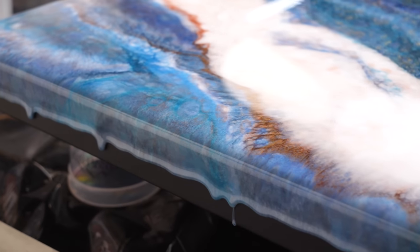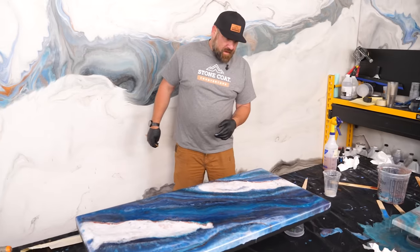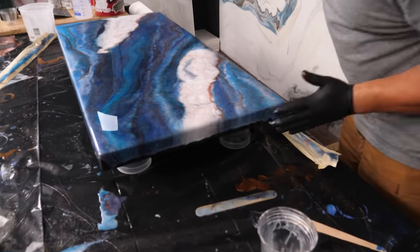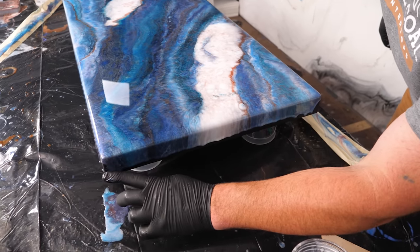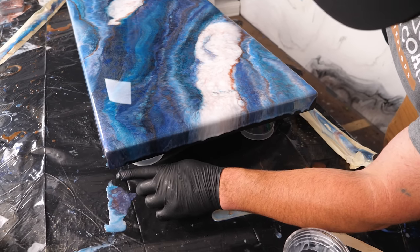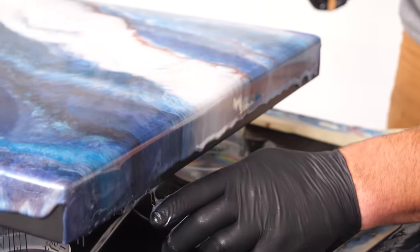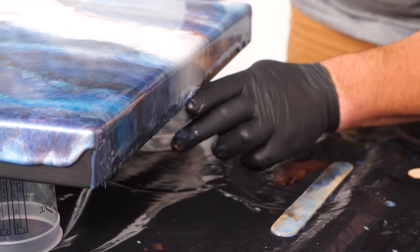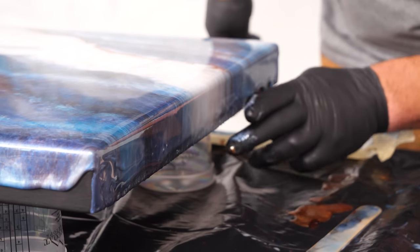I am excited like a kid at Christmas time right now. That looks good. Now that my epoxy is flowing, I want to break up any surface tension. I'm not going to rub this side to side because my pattern is flowing over. But what I can do is rub epoxy on the dry parts of my project aiming down — I just kind of help this flow by making it wet below. Epoxy likes to flow where epoxy has been, so just make it wet below.